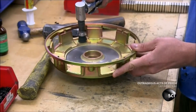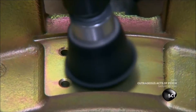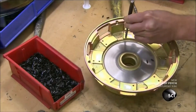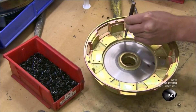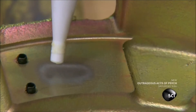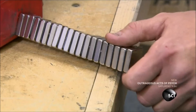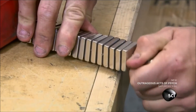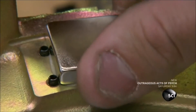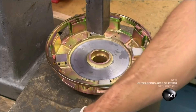To make a zipline brake, they start with a drum made of zinc-coated steel to prevent rust. First, a worker sands off the zinc so they can add the magnets. He hammers locating pins into the metal, applies adhesive to the sanded areas, then places magnets onto the adhesive, using steel pins as a guide. As the adhesive cures, the magnets bond to the metal.